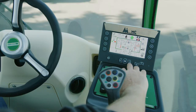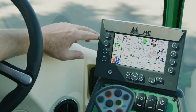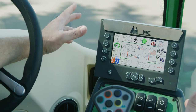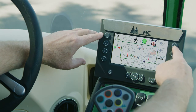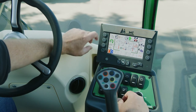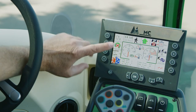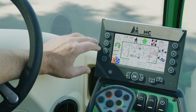To go to screen two, use the right arrow next to the OK button. On screen two, button one is the presets — you have three settings: zero, one, and two. If you like the presets from screen one, set it to zero and press OK for the field conditions of that day. For a second set of presets, go back to screen one, change your RPMs, fan speeds, brush speeds, and cleaning system feeds, then come back to screen two, hit presets, and move over to the next number. You can save up to three presets. Button two is eco mode. With eco mode off, engine RPMs will always stay where you've set them. With it on, when you're not harvesting or moving at full speed, it will bring the RPMs back down.